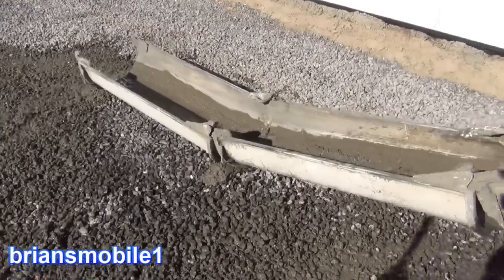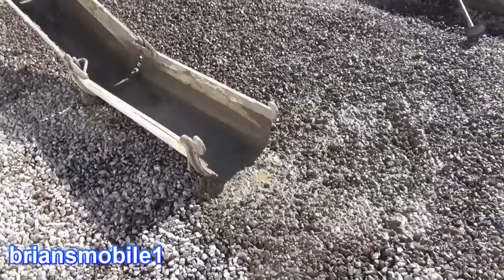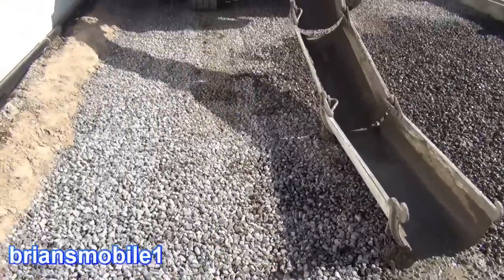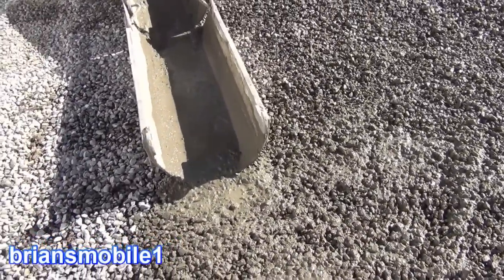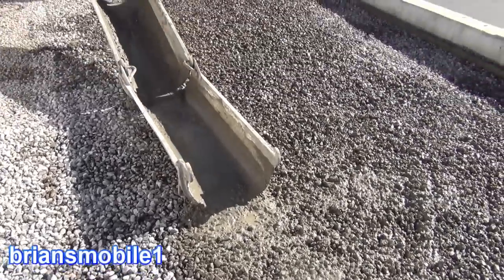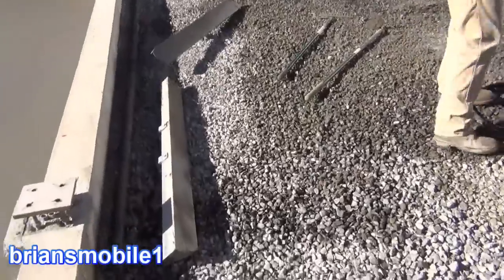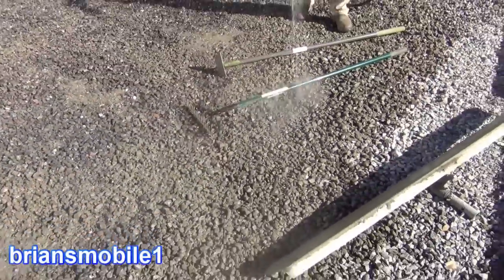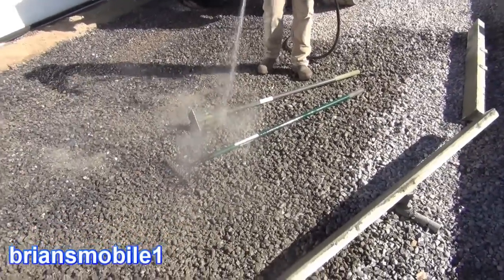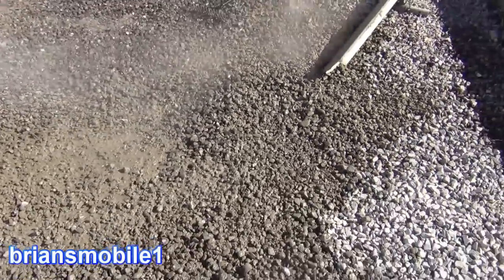The good news is these guys have the equipment to do it. If you didn't have the vibrator or the shorter screed, you'd be screwed. Whenever you're done with a concrete truck, you have to wash it out and have a place to do that. Or if you have a gravel driveway, you can just spread it out — just hose it down. Basically what you're making is just a thin layer of really weak stuff that blends in with the rest of the gravel. When you're done, just take all your tools, lay them out, rinse them off into the gravel.